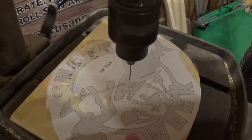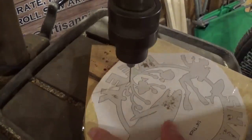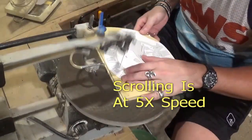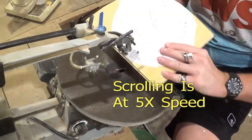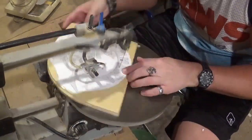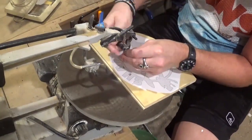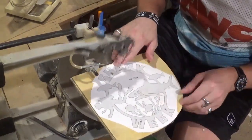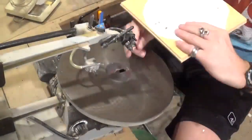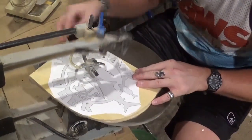Over here on the drill press, we are going to begin by drilling all of our pilot holes for internal cutting. Then we're going to head over to the scroll saw and start scrolling, beginning with some of the smaller interior cuts first — like in the letters, and then down at the bottom of the piece with the coral. I'm going to get all those cuts out of the way first. Always try to go from your smallest inside cuts to the biggest inside cuts.